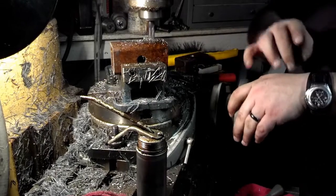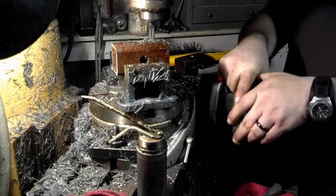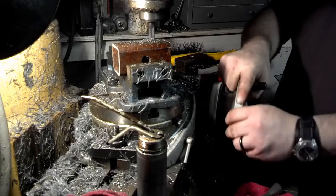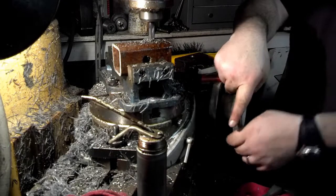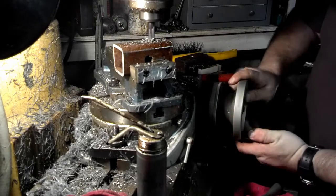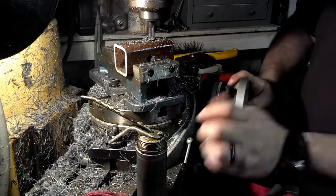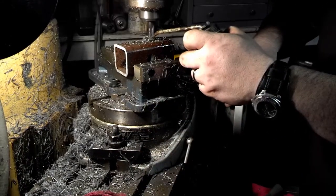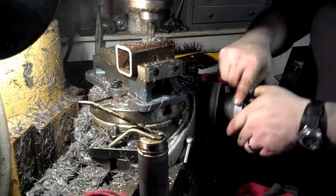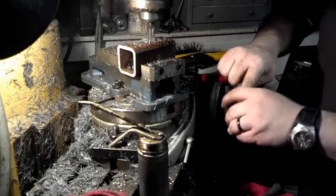Now, one might be tempted to turn the spindle speed up and get greedy, but this is high-speed steel, not carbide. I'm already getting a rather efficient cut here. Having a fan blowing from behind you keeps it cool and keeps the smoke out of your face.